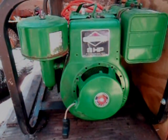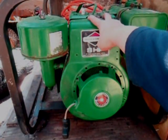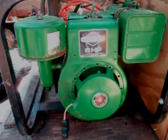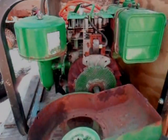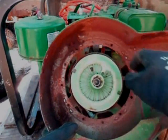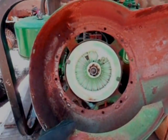I researched it to try to figure out how to fix it. This entire shroud has two 7/16ths bolts here, one right here, and one right here, and I'll take it off and show you what it looks like underneath. I remove the four bolts, and then this whole shroud comes off, and here's the inside of the pulley system. I took it apart earlier and confirmed that the spring is in fact broken in there.